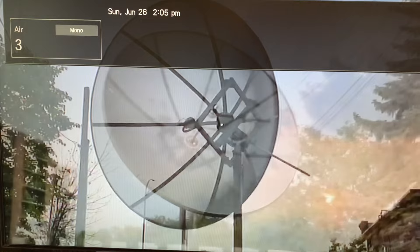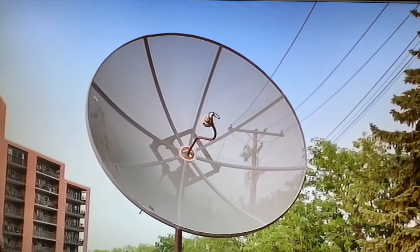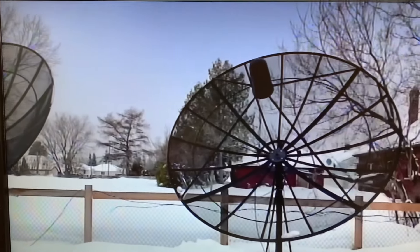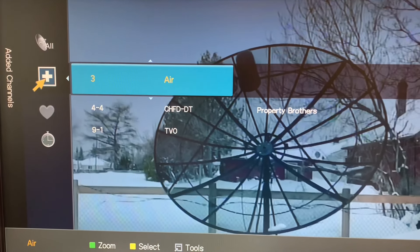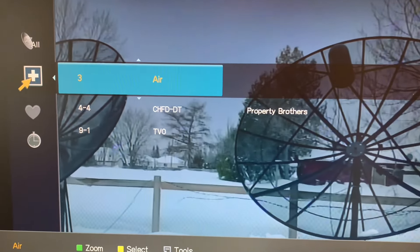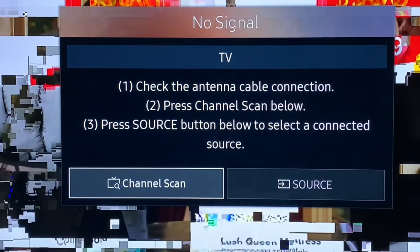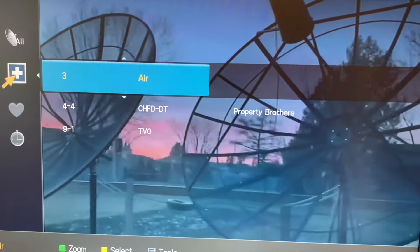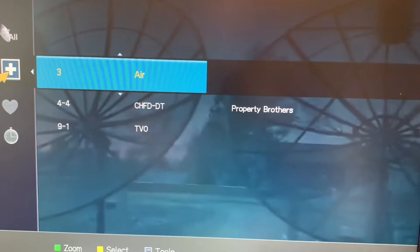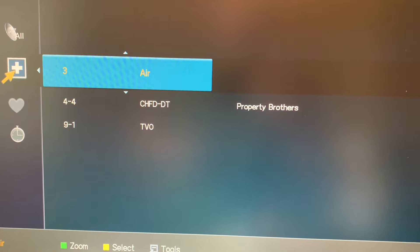This is the channel that I created — it's playing on channel three and these are my videos. However, a problem has arisen: if I look at my channel list, I'm missing one of my over-the-air channels — channel two — and the reason is co-channel interference between channel three, the channel that I made, and my over-the-air channel two. In my area, the best solution I found is to use a UHF modulator so I can make my own private channel on a UHF TV channel that's far away from all the over-the-air channels and prevent any co-channel interference.